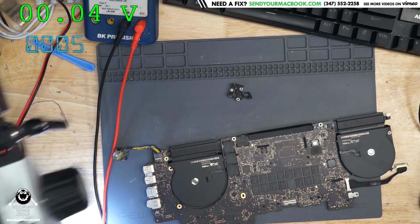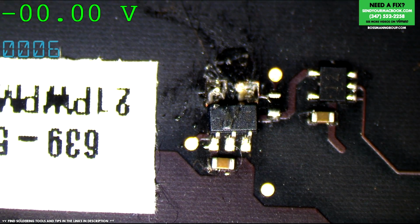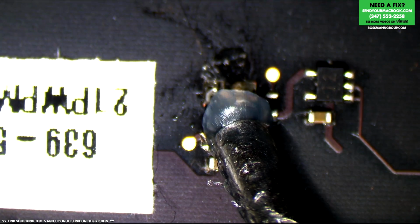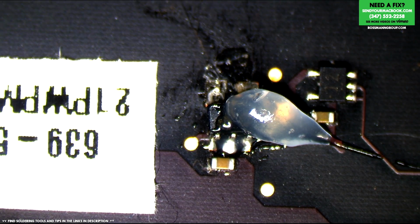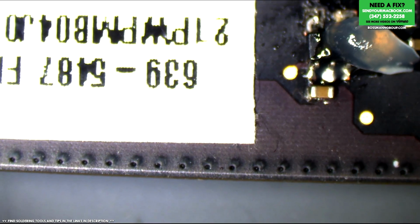Which makes me wonder if this chip is shorting adapter sense to ground. This is behavior that I have never seen in all the years I've done board repair. I've never seen a Max 9940 chip from the one-wire circuit shorting adapter sense to ground like that. That's really strange. But you never know. Maybe this will be our problem.